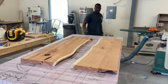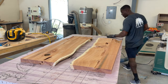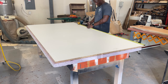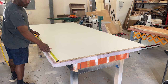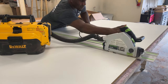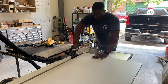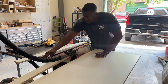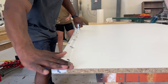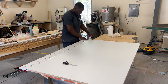Here I'm finding the best format for the river, just testing different things out, flipping the wood over, seeing what makes the most sense. Once we had the format set, it was time to make the mold. We're using particle board — it's cheap, and if you ruin it you can throw it out and remake another mold. The mold was a few inches bigger than the actual table on all four sides, so there was a little bit of play when it came time to cut it to its final size.